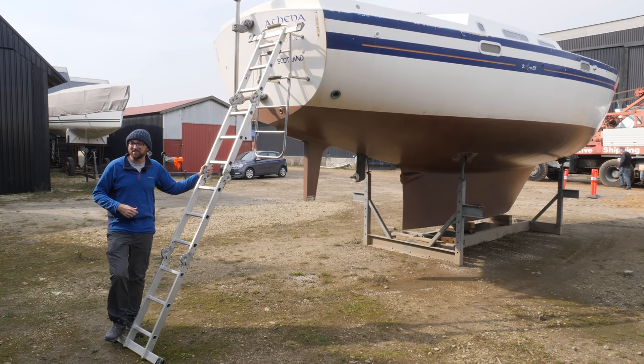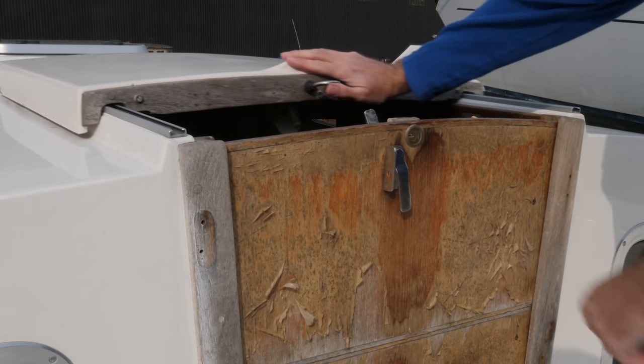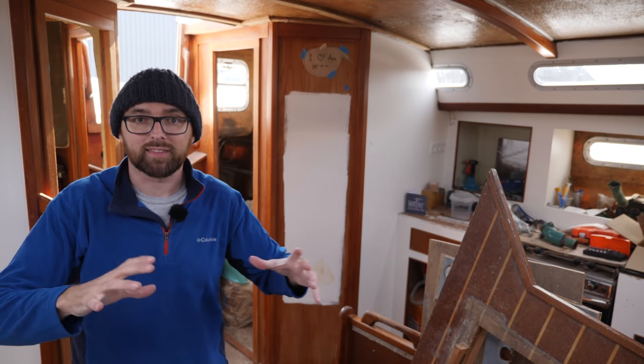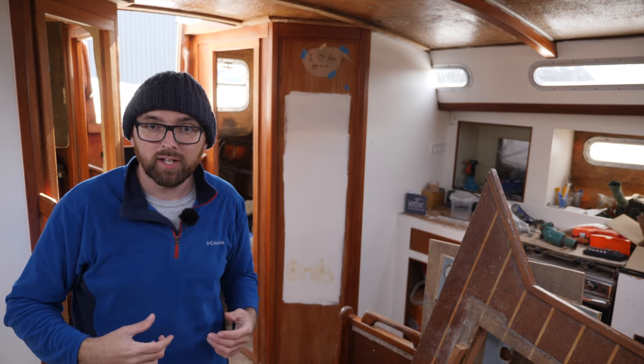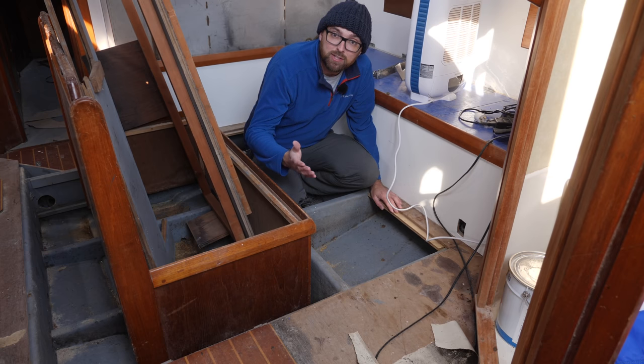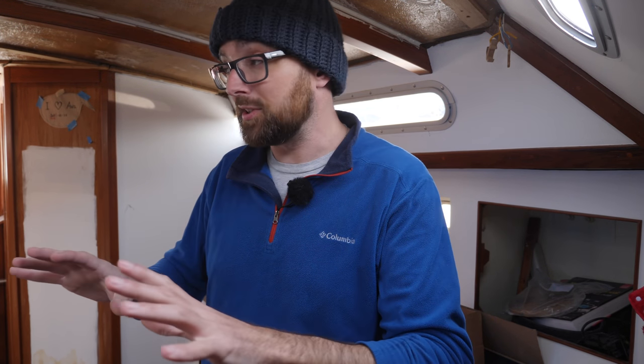The big push of summer 2019 is just around the corner. As soon as it's warm enough to work with epoxy, and as soon as I've confirmed with the yard that they're not going to be moving Athena around a lot, then I can tear out the interior here in the saloon to get to the structural members underneath the cabin sole. The short version is that the core inside those structural members is not doing well — it's plywood and it's wet. To put a lot of time and effort into an interior refit without addressing that would be like slapping lipstick on a pig, and I want to make sure Ava and I don't have to go through any major surgery here aboard Athena after we've moved aboard.